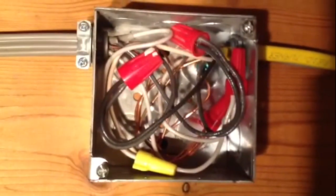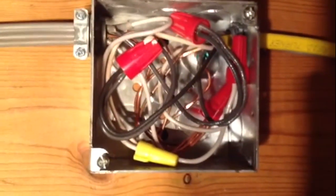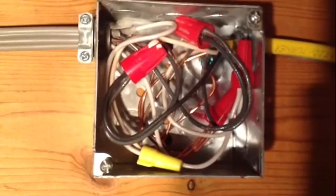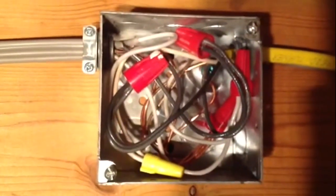And that's how you wire up a 4 inch box. I showed you the circuitry to hook up our lights with GFCI protection. Now normally if you were doing just a porch plug — here's a close-up of the wired-in 4 inch box. The grounds are first, then the whites, and then the blacks. Use wire nuts on all your wires, same on the grounds. The next thing we'll do is put a 4 inch cover plate on that, but that's pretty self-explanatory. And there you have a wired 4 inch box.